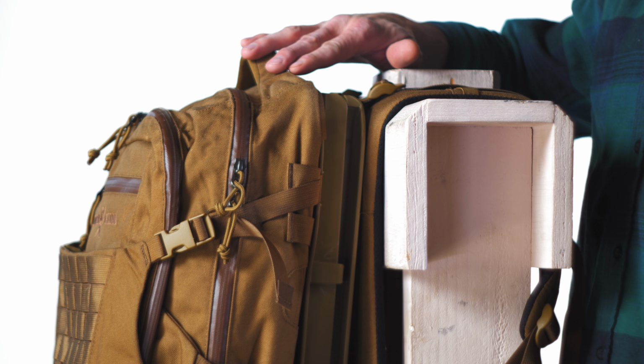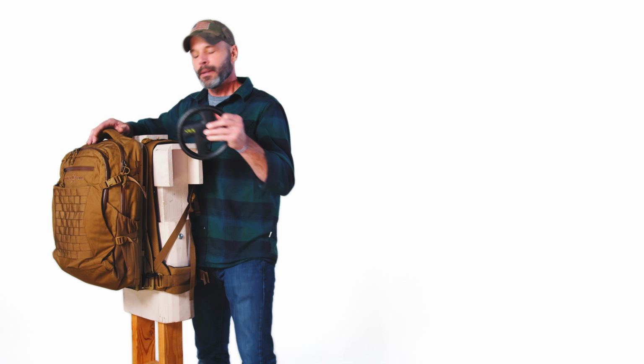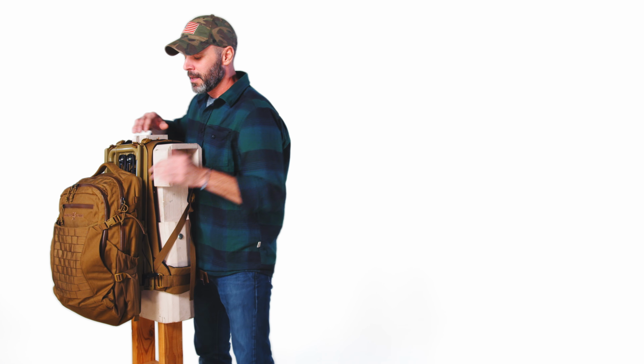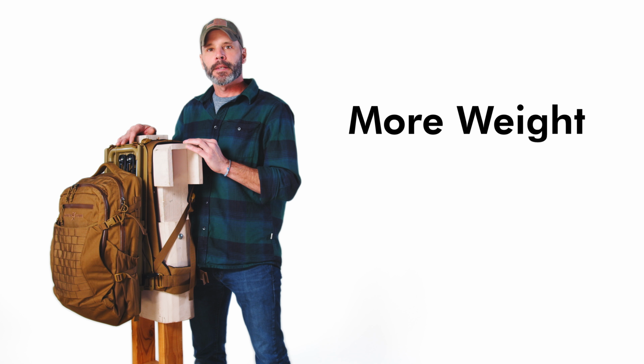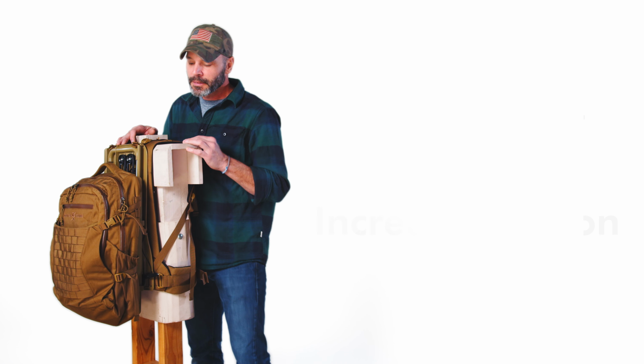For demonstration, here the HoverGlide is properly adjusted for the current weight. The top of the moving frame is flush with the top of the fixed frame. Say we add 5 pounds to the load. You can see this pushes the moving frame down to the bottom of the fixed frame. In this case, we need to increase spring tension to raise the moving frame back up.